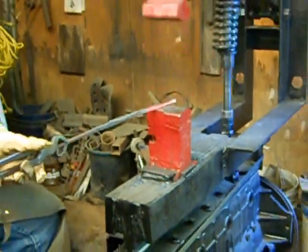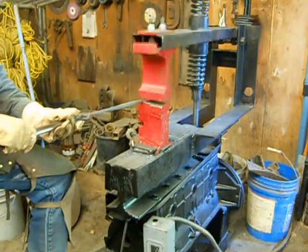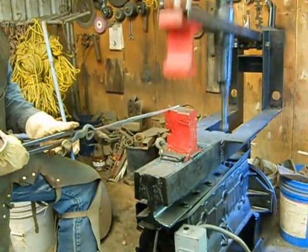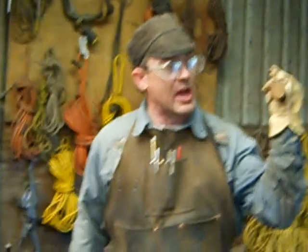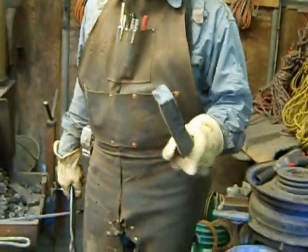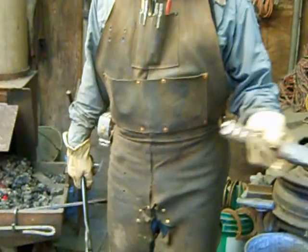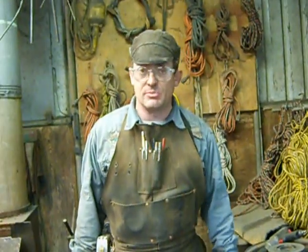You can see I have quite better control with the power hammer. This is inch-and-a-half rebar - in four heats I was able to take it down to inch-and-an-eighth square approximately. Only an 18-pound hammerhead, but I have it counter-balanced so I could put heavier heads on if I choose. Right now the 18-pound seems to be moving the metal quite well. All right guys, thanks for watching.